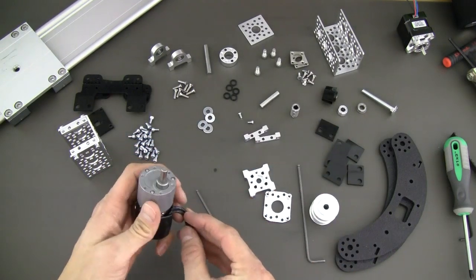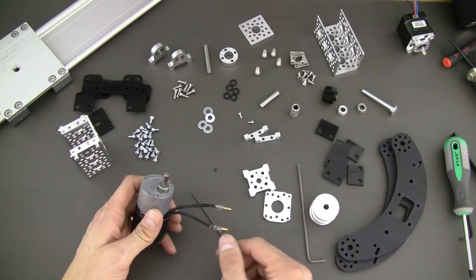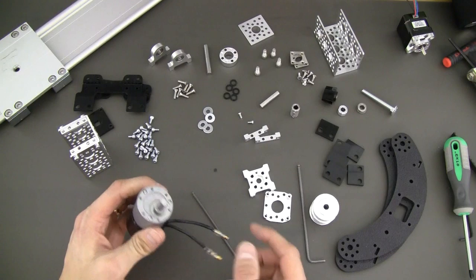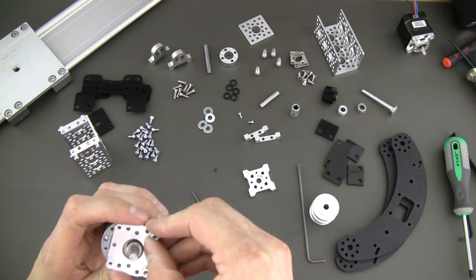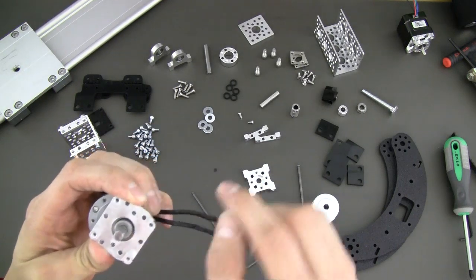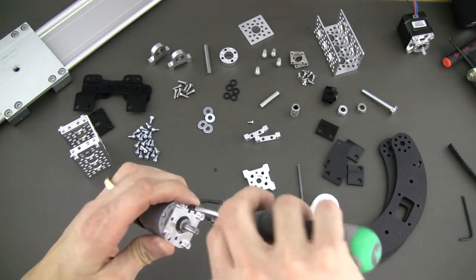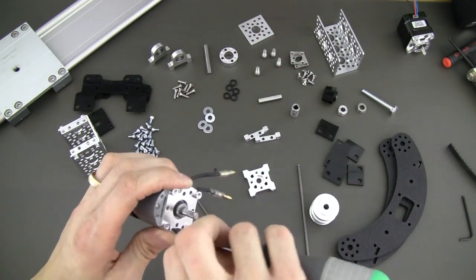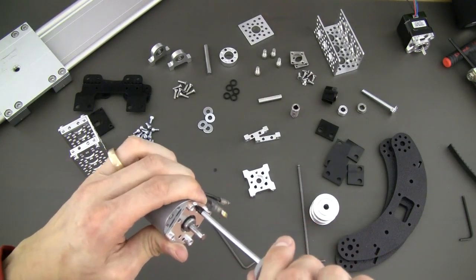We're going to use this — I think this is a 60 RPM motor. 60 RPM is a pretty good motor to start with on the Aigis slider because it offers a good range of speed: relatively slow, but it can also give you decent speed depending on the type of shot you're wanting to do. You might have to rotate the motor to index the correct holes so your output shaft is directly in the middle of the motor mount. These are Phillips screwdriver screws — they're little 3mm screws — so go ahead and tighten these down.